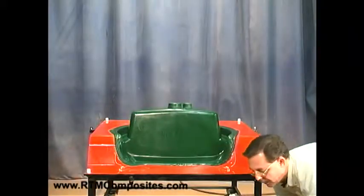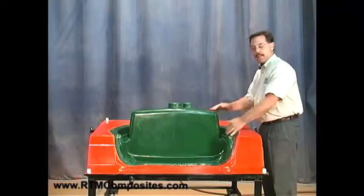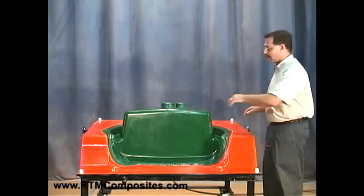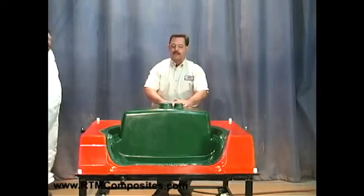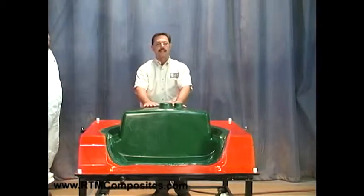There's your molded part surface. Remember, we had green resin and we've got white gel coat below this. The finish of the product against the mold surface is put in first — Don was spraying the gel coat. So now we've got the finished molded back side. If we were hand laid up, this would be all rough. See how smooth — that's the beauty of closed molding. We get two smooth finished sides.